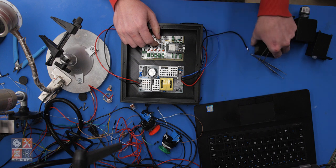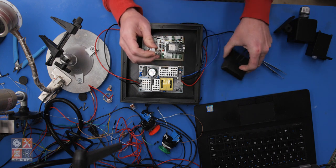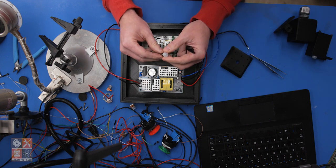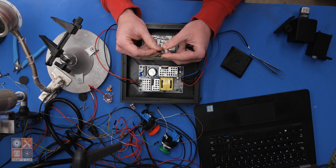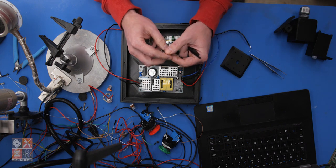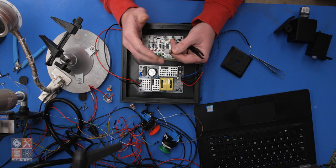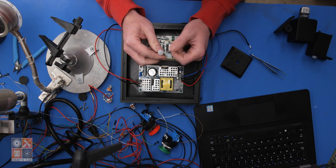The PIR sensors are neat. They operate from a programming perspective the same way a switch or push button does. You power them with 3 to 5 volts and connect the output pin to any one of your microcontroller's digital pins, and then it's just a matter of programming with the same digital read high or low that you would a switch or a push button.